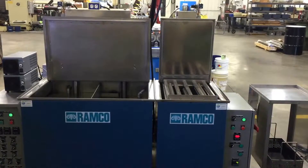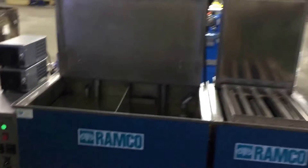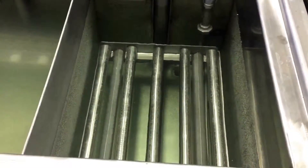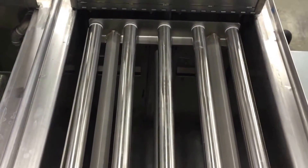Today, Best Technologies is at a CNC machine shop installing a wash, rinse, and dry agitated immersion system. It has ultrasonics and turbulation in the wash tank, platform agitation in the rinse tank with counter flow or overflow rinse, and a heated dryer with regenerative air drying.